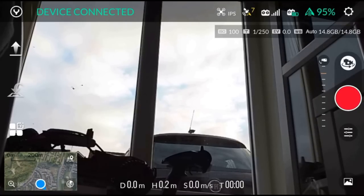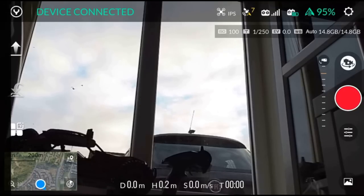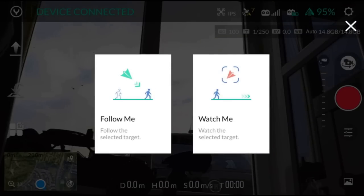On the left-hand side of the screen, you've got the take-off and land button — slide across to confirm it. It will take off even indoors because it's got IPS and it's receiving a good signal. Under that, you have your return to home button and then your modes. You've got journey mode, point of interest, and follow me. The follow me mode puts a box around a subject and the drone follows you. Or you've got watch me, where the drone stays where it is and rotates itself to follow you — the drone won't move, but if you move further away you'll be further away in the shot.